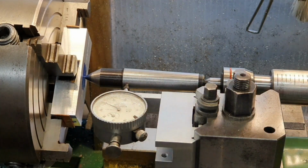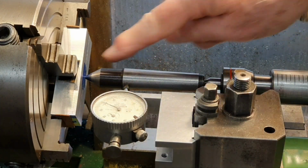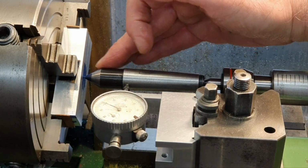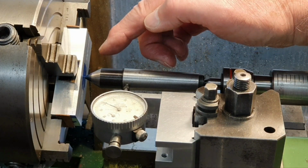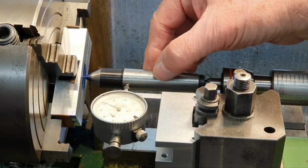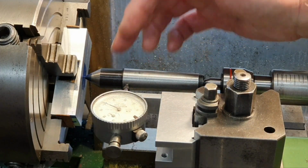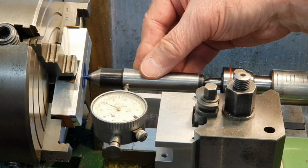But anyway, I've got this all set up now, so I can break all this down and then start drilling through. So I'm going to centre drill and then use a number of drills to bring me up to size. And as I mentioned, I'm going to drill this so I can ream it to a 1/2 inch. So I'll end up with, well, the nearest I can do it I think is an 11.5mm drill, which will give me a reasonable drill size for the 1/2 inch reamer.